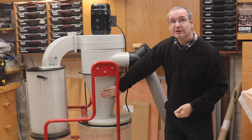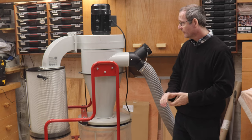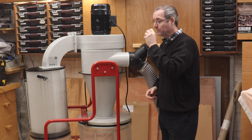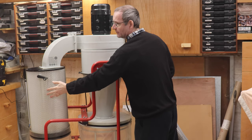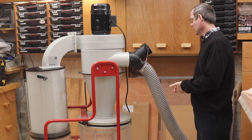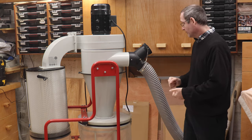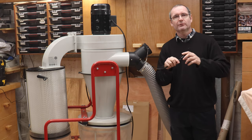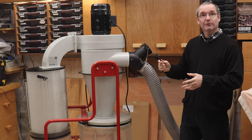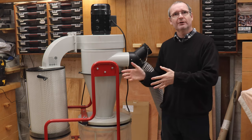There's a cyclone down in here — this is the cyclone. There's a dustbin down in here, and I'll show you a better view of that. Any very small pieces of dust go into this chute here, hit this filter, and go into another dust bag down in there. I'll get you a better picture of that as well. What can I say — being two horsepower, you're able to run it off the normal 240 volts, 13 amp that most people have in their household. You don't need any special extra power or anything like that to run it.